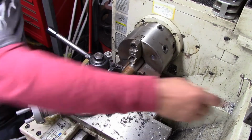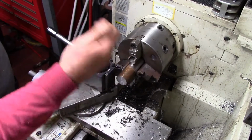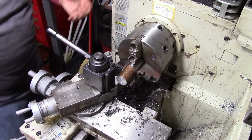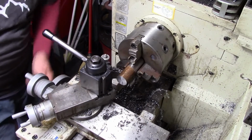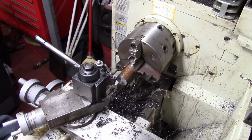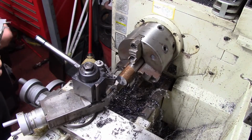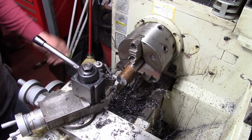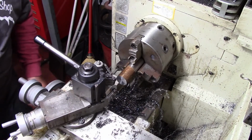The plate that I'm going to eventually use for the wheels is going to be threaded on it with a nut instead of trying to lock it any other way. Again, we're not going to be turning this a lot of RPM. So I'm going to just basically cut it down to a quick 1/2 inch, a little over a half or just a little under. We will run a die up it and we'll thread it.